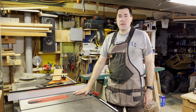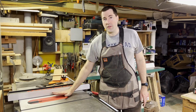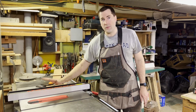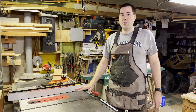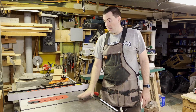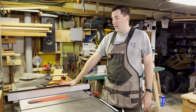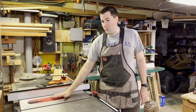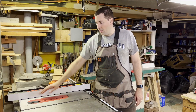There are a lot of other adjustments you can make on the table saw — the insert, making sure it's nice and level and flush with the top by adjusting four screws, that's pretty straightforward. You can also adjust the tilt mechanism and its stops, though I haven't found that to be too much of an issue so I'm not going to cover that. The next adjustment that goes along with the miter slots and blade is to adjust the fence — the miter slots are now nice and parallel with the blade, so now we want to make sure the fence is too.